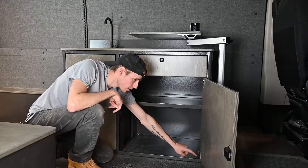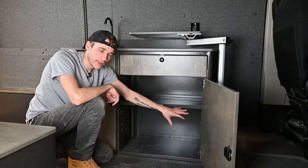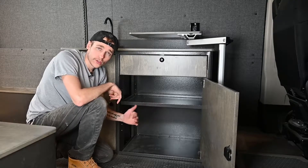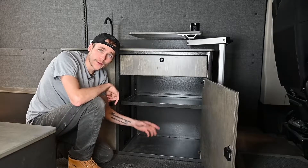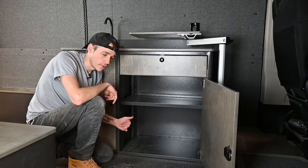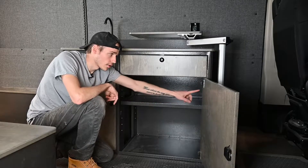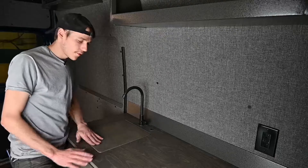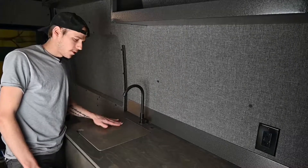We personally have one on and one off, so the door closes softly and quickly. If you wanted it to close slower, you would turn both switches on and it would close much slower. If you wanted it to close fast, you could turn both switches off and it will close fast.